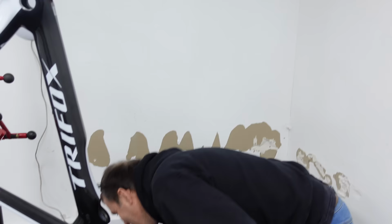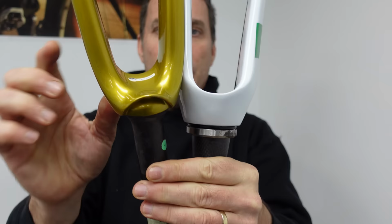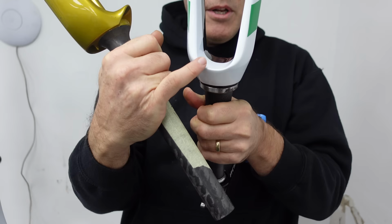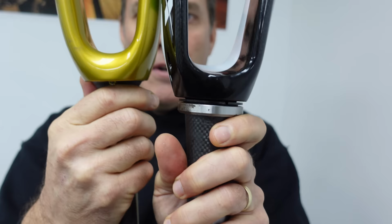So the stiffer one is actually similar wall thickness. We're looking around here. Yeah. The thickness here. So my question is then why, if it's carbon fiber, why is this one flexing so much more? And it could be two things. It could be as simple as the radius on the base here is too tight. Yeah. I think it's quite tight if we take this side, okay? It's quite a tight radius compared to that one. Look at that one. It's much rounder. And what that does is it causes a lot of tension in this area, flex tension, whereas this one is more represented on this corner.